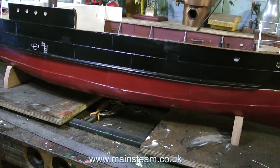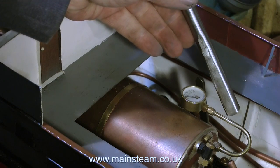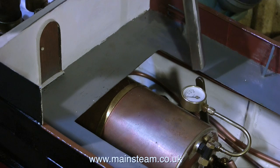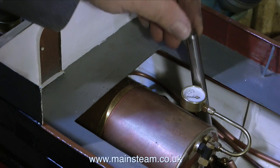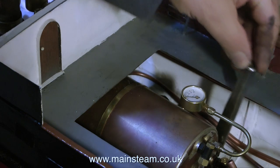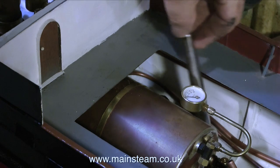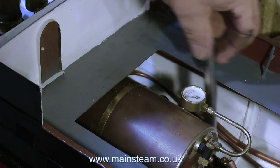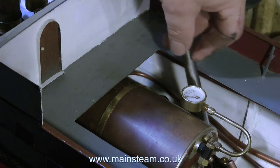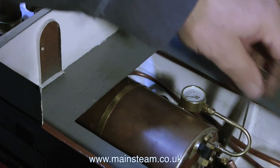These are for ornamental purposes only and they will look very ornamental when they've been varnished. Apart from the rear handrail job, which is not going to be fun, the last part I needed to make was an extension handle for the water pump. This is made from a piece of thick gauge stainless steel and it took quite a lot of pressure to flatten part of it in the vice. This simple hand pump lever is a very essential accessory — not only does it make it easier to pump water into the boiler from a leverage point of view, it also stops you from colliding with the pressure gauge and stops any risk of slicing your finger on the edge of the decking.